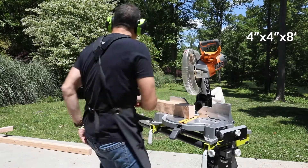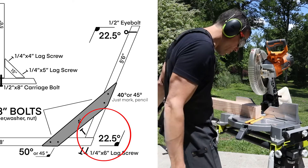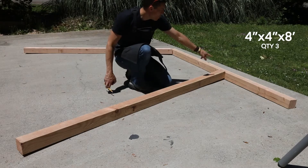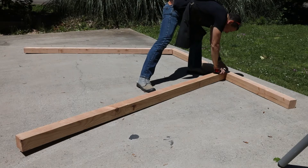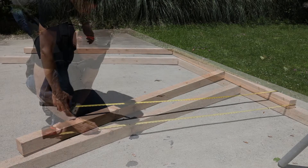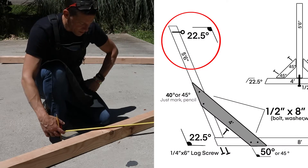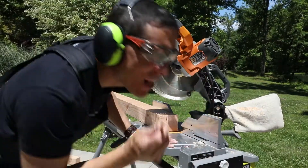Let's do it to one more board — two boards cut at 22.5 degrees. I'm at just about 11 feet where I need to be. I moved this board over just a bit so I could get a square line off of it. I'm going to double check that my angles line up, which they do. Then I'm going to grab my tape measure — that's where I'm going to make my cut. 5 feet 6 inches. Hopefully I didn't mess it up but that looks pretty good. Let's cut it. There's one.